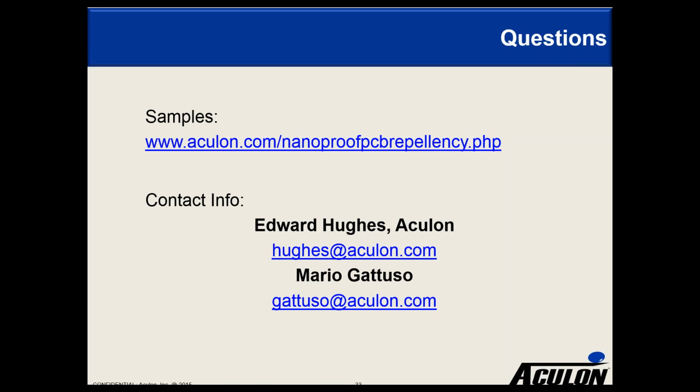I'm not sure if this person is inquiring because they want high temperature curing or if it's not desirable, but the person has asked, is there a high temperature curing step? No, none of them require high temperature curing. They can take some high temperatures after being coated, so I don't know if that was the concern. We wouldn't recommend going over 200 C for any of the coatings. So I think by design they don't require a cure. If you want to increase the speed of the line, then a cure is there, but don't go over 200 C.